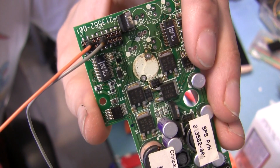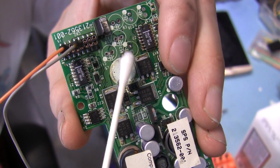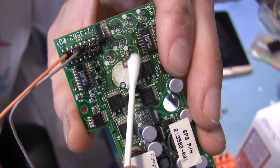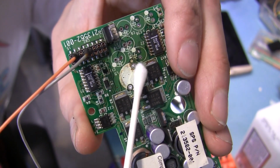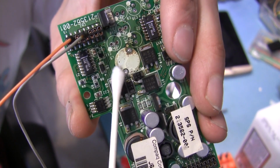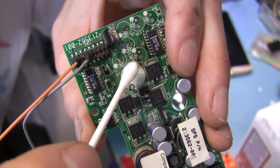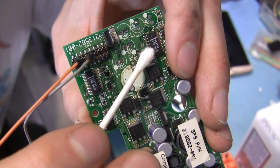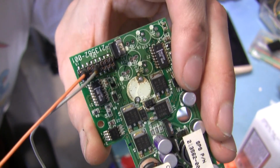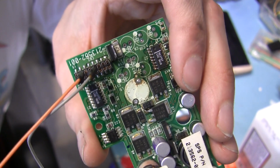Alright, so I lifted off some of the extra capacitors here. And what I discovered was more of that black goo, and it really looks like flux that's slowly carbonized or something like that, or started to eat away at the board. So I went ahead and pulled off a whole bunch more capacitors, and the inductor, actually. And yeah, there seems to be goo kind of everywhere. If you look at this chip here, you can see that there's lots of flux on there, so I don't know, maybe the heat of the inductor or whatever activated the flux and it just kind of ate through everything.